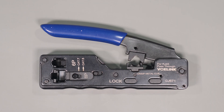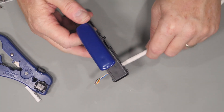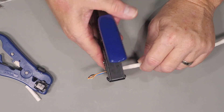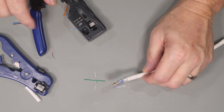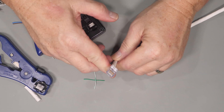Lastly are crimpers. These are obviously required but fortunately most made for network cables are pretty universal. When you look at the product description you'll often see the phrase 'pass through' listed. This indicates it was made for a pass-through style RJ45 connector, and they typically have a cutting blade that trims off the excess cable after crimping. Non-pass-through connectors are typically much more difficult to work with, so I tend to stay away from them. My suggestion is to get a pass-through style when ordering both your crimping tool and your RJ45 connectors.